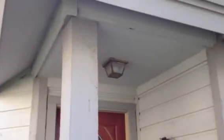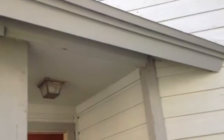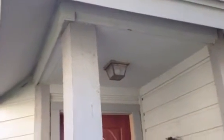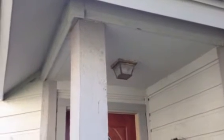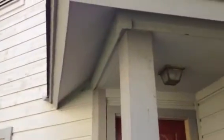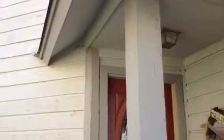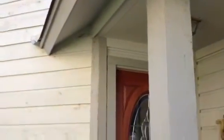We have a little bit of porch ceiling here, about a 5x5 area. We'll look at probably doing that the same. We have this soffit outlining that porch, so we'll install a Hardie porch ceiling just so that it's continuous with the soffit that we're going to have right next to it. We can wrap this porch column here in Hardie plank just so there'll never have to be any maintenance or repair work done on that.